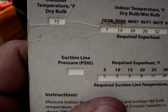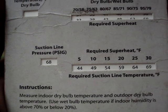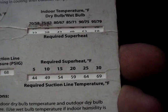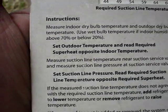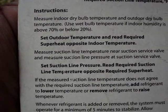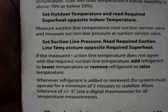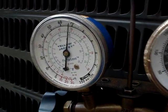Let's set our suction line pressure — that's 68. If you go up between 5 and 10, we're looking at about 47 degrees or so. We are at 44.9 to 45. And if you read on, it says you can be within 5 degrees or within a couple of degrees. So it looks like we have the proper charge. And that is how to check superheat on non-TXV systems.